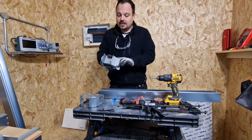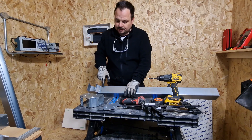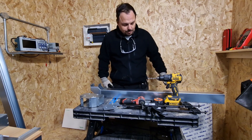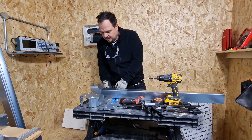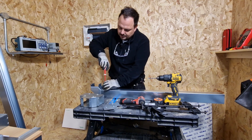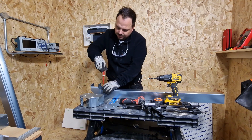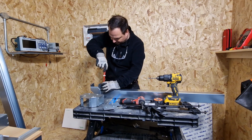You can see here they simply just clip together, so it's really straightforward. This one is the end of the trunking with the pre-drilled holes. If you're coming to fit it onto the opposite end which doesn't have them, you'll have to mark and measure those holes. Basically pop your trunking on, get your screws and screw it together — it is as simple and as easy as that. I'll screw this together by hand sometimes, because you can bust the threads on these; they are just a very thin material with a thread cast into it, so if you go too mad trying to rush you'll find you burn it out.